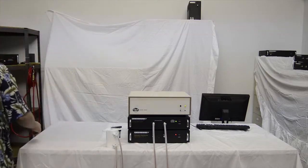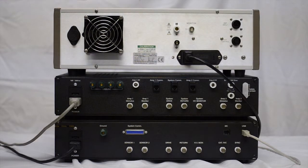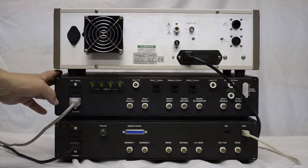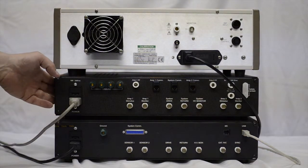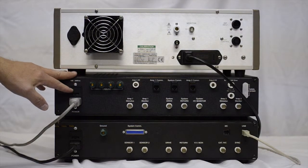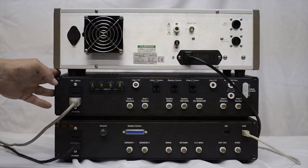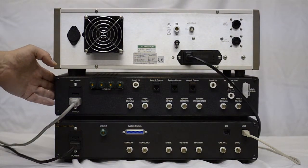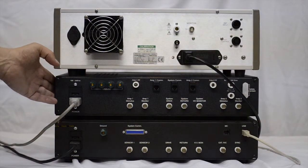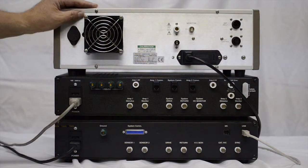The remaining configuration is done at the rear panel of the three instruments: the HVA, the HVI, and the Precision Tester. There are several models of HVI, characterized in two ways. The first is the physical communication between the three instruments — older HVIs used a 25-pin parallel connection, while this more up-to-date HVI uses I2C communications over a cable similar to a telephone cable. The second distinguishing characteristic is whether the HVI is a single-channel or dual-channel interface. This model has two channels, allowing physical attachment of two separate amplifiers that can be switched in software without any hardware change.